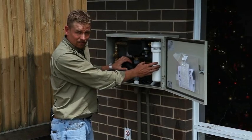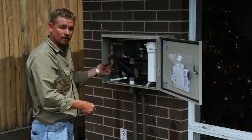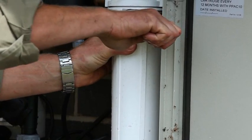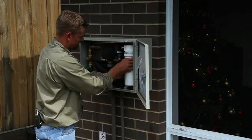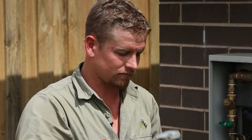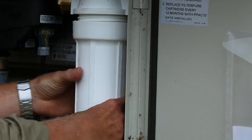You may also have a filter on the outlet side of the controller. This is the same procedure — the power needs to be turned off to the pump and the water off at the mains. Some come with a bracket wrench like this to undo the filter. The filters in these housings are a cartridge type. These are discarded and new ones are bought from hardware or plumbing supplies. Reinstated back and reinstalled.